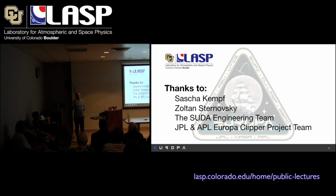What happens is when those particles hit, water is hard to ionize. The other stuff is a lot easier to ionize. And so there's preferential ionization going on in the impact physics. And so we actually see the contaminants in the water a lot more than we see the water. And so there's actually an amplification of those minor constituents in these impact mass spectra. So it's a very powerful technique in that regard.